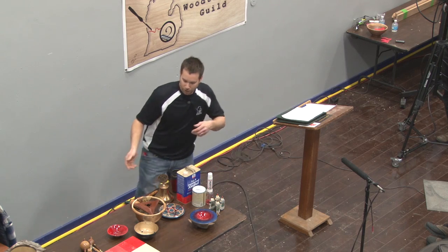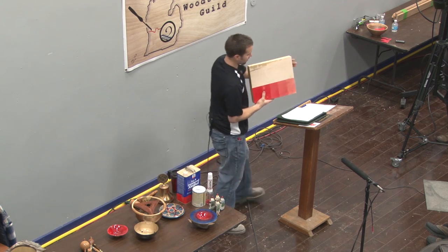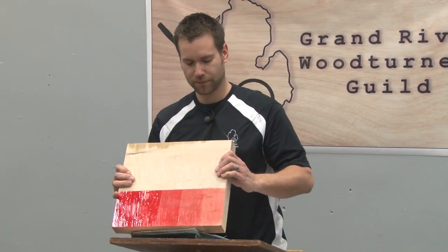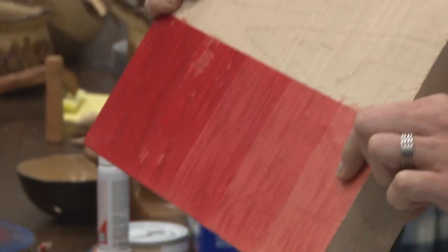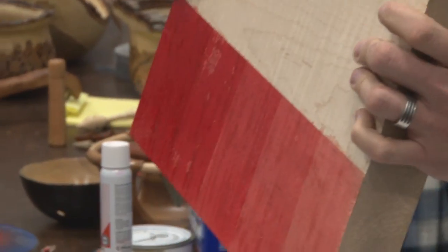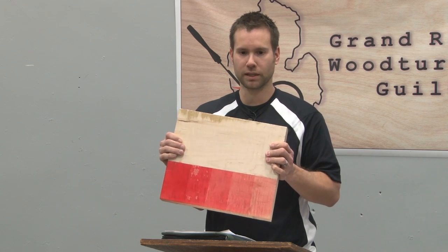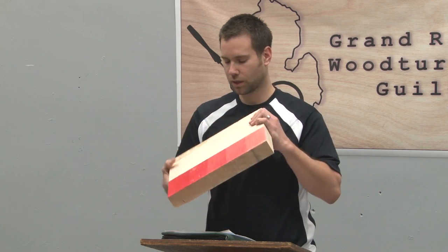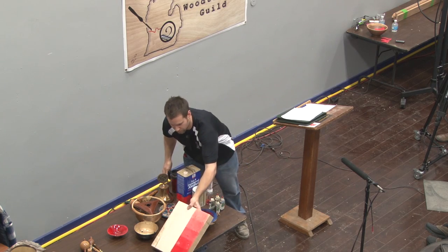For example, I used a piece of figured maple. It started out with the first couple of coats of tint, and then I just kept adding two coats, two coats, two coats. All it did was accentuate the grain inside the wood — it didn't impede it at all, which is why I like using it so much.